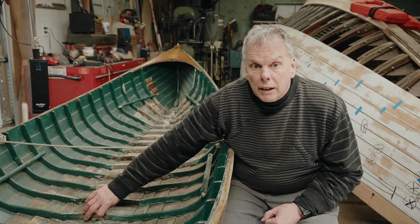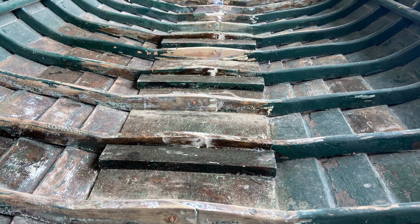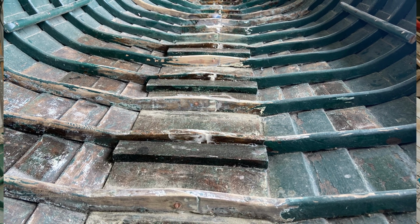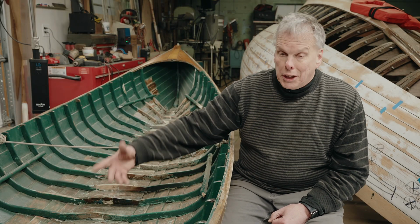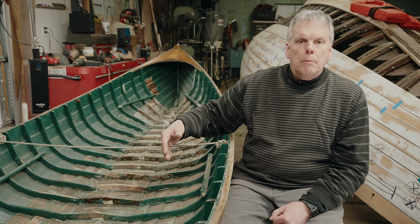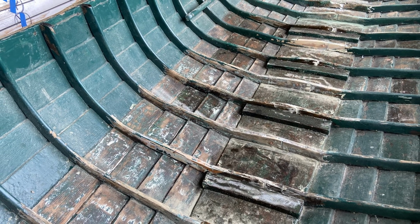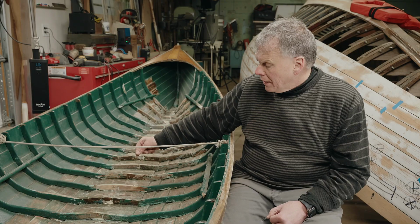And then I put a rivet in the joint, because the rivet was going to give me a much better fastening than the little copper clench nails did. And it was something that was removable, and it wasn't going to damage these rather short scarfs that he had in here, or she. So that's what I did. I went through every frame and I opened them up and took out the original fasteners, cleaned the glue out, and then refastened it based on what was around it, what fasteners I could use that made sense.